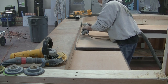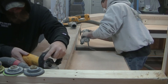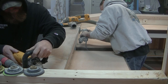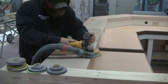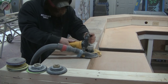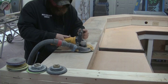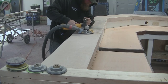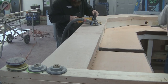The good thing about working in this setting is they were remodeling the whole room, so getting a little dust on something wasn't a big deal. If you're doing this in your house, you're going to want to poly everything off that you don't want to get dust on, and definitely have a HEPA vacuum hookup — you can rent those — and just try to keep the dust down as much as possible.